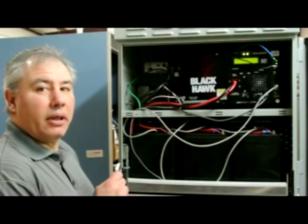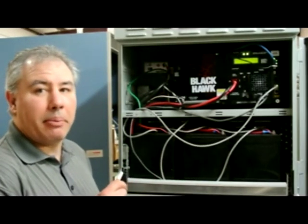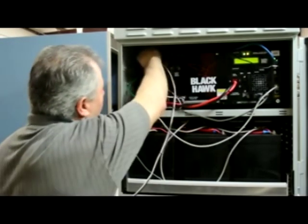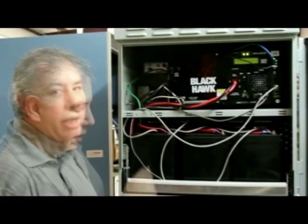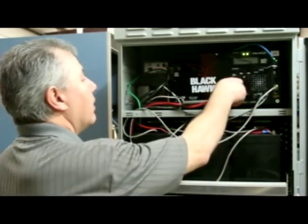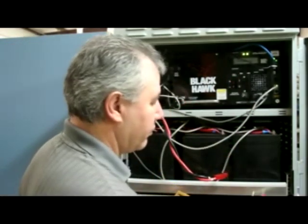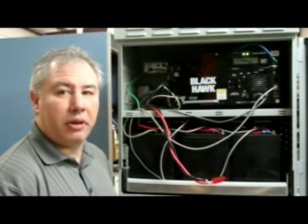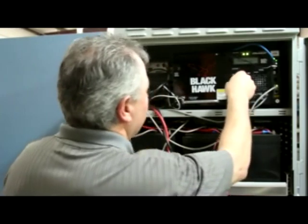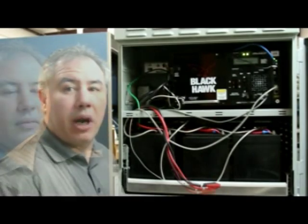Next step is to attach the transformer to the batteries that are going to bypass the main unit. The plug is to be inserted into the PIM-F. Next, using a multimeter set on VDC, pull the main power cord and verify the unit is between 40 and 42 volts DC. This indicates the charger is working properly.